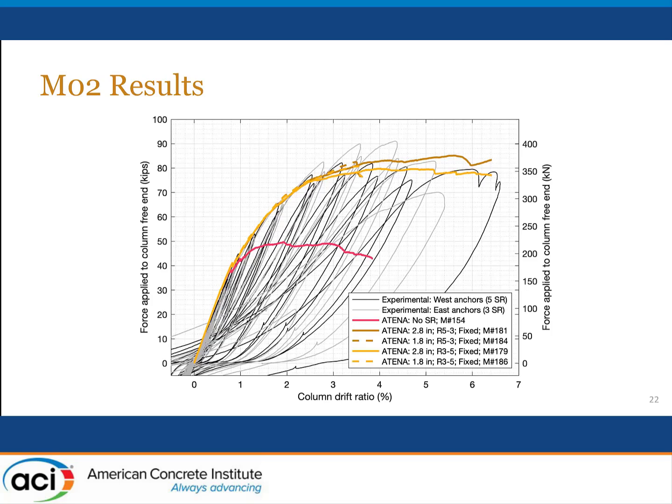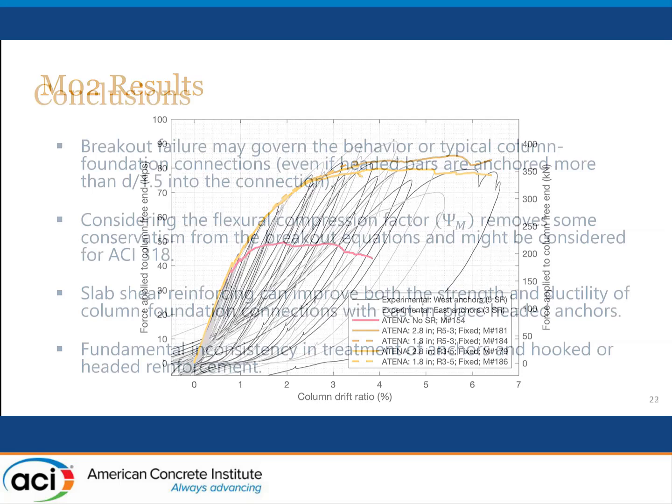John Silva won a bet with me. It turns out that in terms of strength and almost deformation capacity, 2 rows of the candy cane bars was just as good as 4 rows. And so I think we learned something there about where to place these bars to achieve maximum effect.